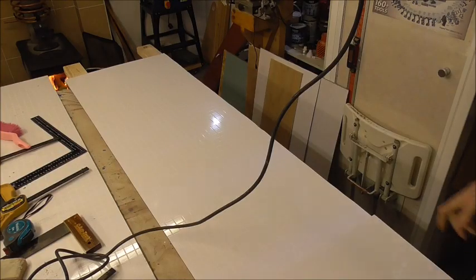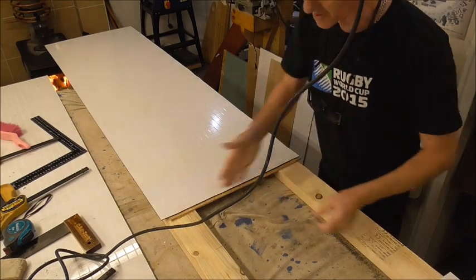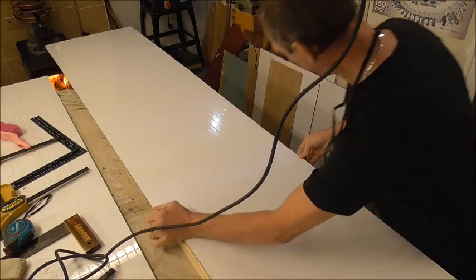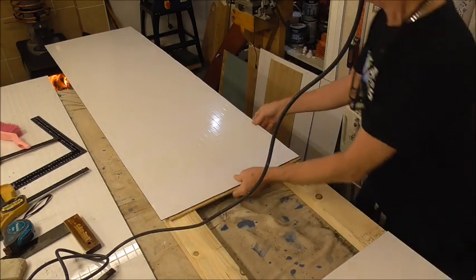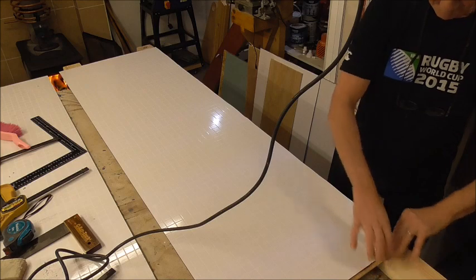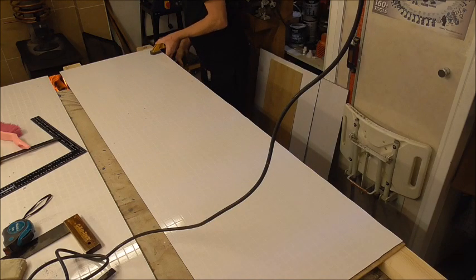Now when you're doing this, you've got to bear in mind the tiles need to match up. So before I router this out, this being the long panel, it's going to turn at this point and go down the bath. I want this one to match with that one. So that will do it. I'm just cleaning up the top of that. That's all I'm going to do. Now the method I use to set these is I'm just clamping it to a piece of wood, a big long piece of CLS. Clamp it enough to stop it moving.